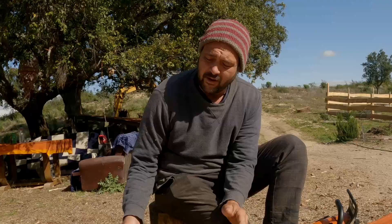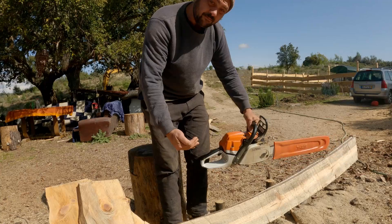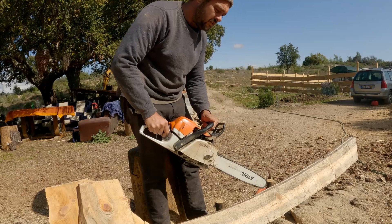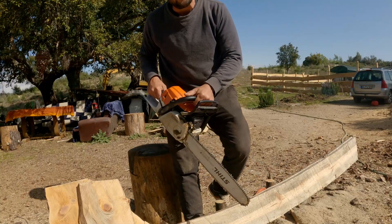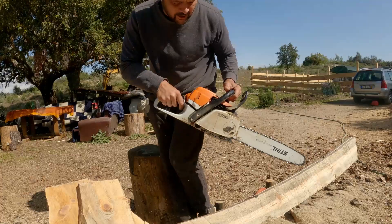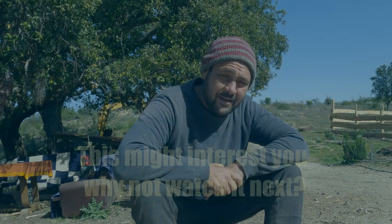I hope you got something from this video and it'll help you out. One more tip: when you come to the last cut, I always stand on this side of the log. When you're scoring the last cut, there is a danger — because the log is rounded down, when you do the first score it can slide off, which is super dangerous. What I do is go on the other side and get a deep enough score for the tip of the chainsaw to fit in it, then you can either keep cutting like that or go back around and do it without any danger of it slipping out of the groove and hitting you. If you got something from this video, don't forget to comment, like and share. Take it easy and I'll see you next time.